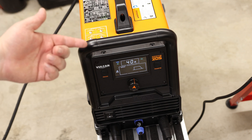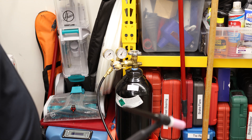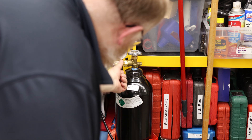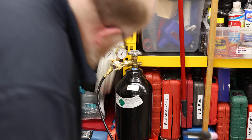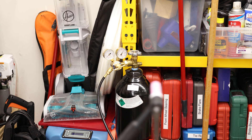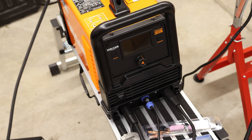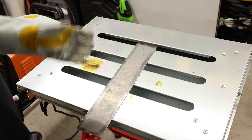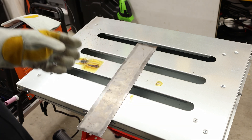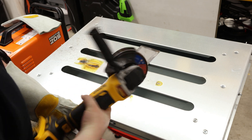So now we're going to set the pressure by tapping the pedal. We're still at a little bit over 20 — I'm going to reduce this to 20 cubic feet per hour with a number 8 cup. Because there's one very important thing we have to do if we're going to be TIG welding, and that is clean the metal. If you're used to stick welding or MIG welding and you're used to not really cleaning the metal, if your welds are coming out bad when you're TIG welding it's probably because the metal isn't clean. Super common mistake — so invest in flap discs.